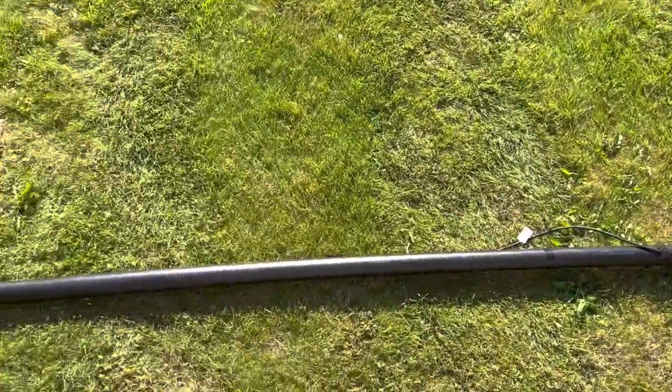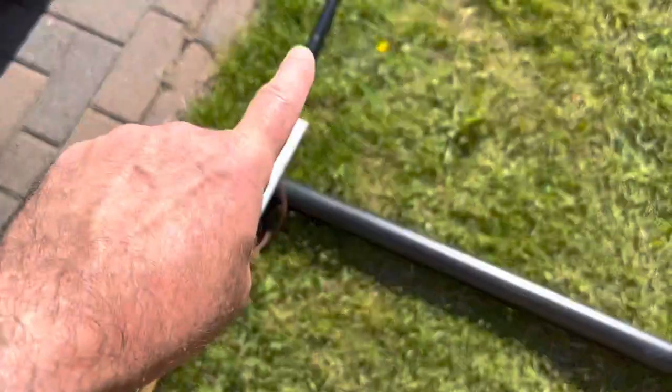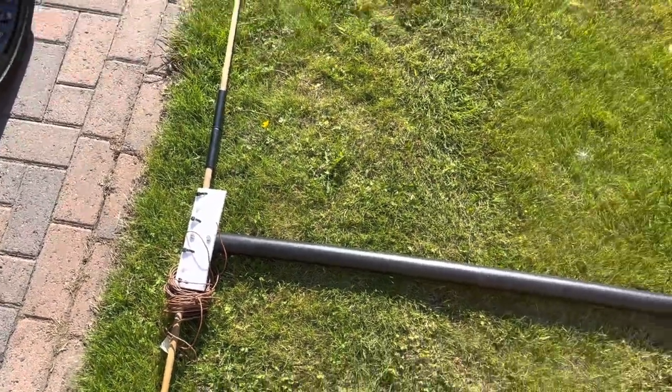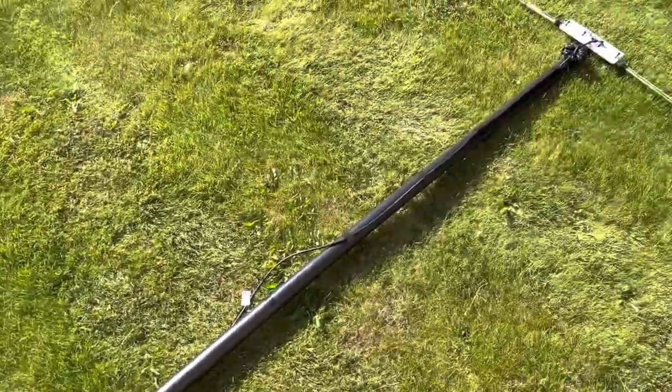As a PS, thinking ahead — I need to find the balance point in the middle for the center fixing, because that end's got coax and a choke on it. I've attached the rear element; both element wires, the coil wire, and the two coil forms are attached on there. That's all there's going to be on there, so in theory this is the whole antenna. When I lift it and find the balance point it should be reasonably accurate.